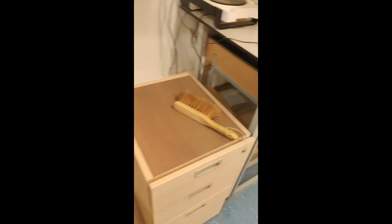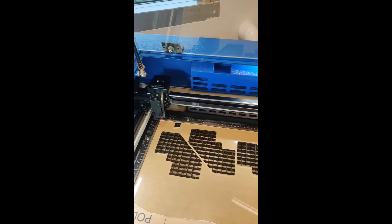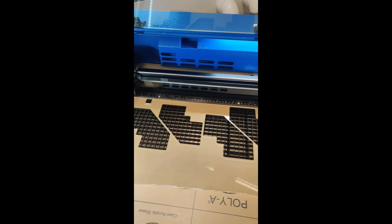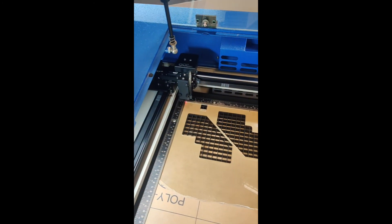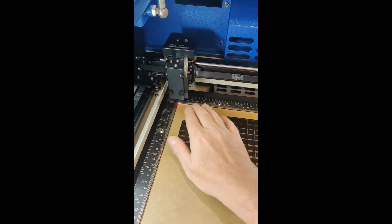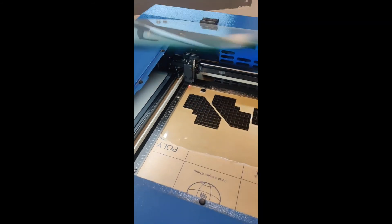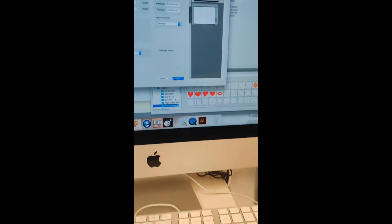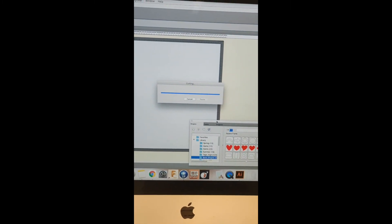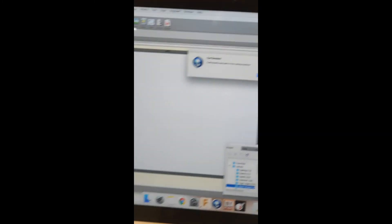If you go to Home it will start there automatically — we want to start there. Get your material. Take the paper off the front — it's better to take the paper off the back too, but definitely off the front. The screen is about five centimeters — I'll cut it in that little area. Put the material in with no paper in the way, set my red dot into the corner, close the lid, then press OK to send the cutting path.